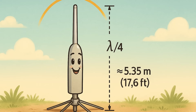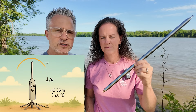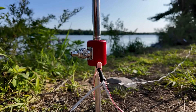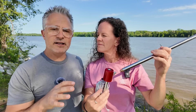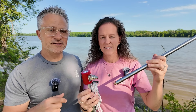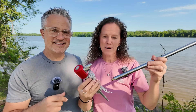The next category of antennas that is also very efficient and famous is the quarter wave vertical, and it's just like it sounds — it is a quarter wavelength of whatever frequency you want to use. This is a 17-foot whip antenna, which is about a quarter wavelength for 20 meters. One of the well-known ones is the Chameleon 750. We have one we got from AliExpress. It includes a ground spike and basically you have a quarter wavelength radiating element going up in the air and then a ground plane at the bottom. This comes in really handy at the beach because saltwater makes a fantastic ground plane.